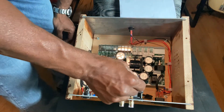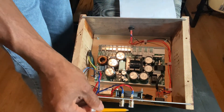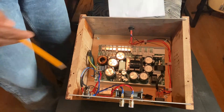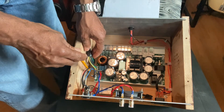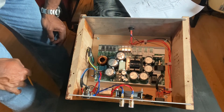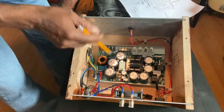I have a cooling fan. I wasn't sure about the heat this would generate, so I drilled several holes in the side of my case and holes in the back, and mounted basically a cooling fan — the kind mostly used for computers. There are DC output connections with this amp. The red and blue wires are 24 volts — I did test these on a voltmeter. The yellow wire is 126 volts, the green wire is 84 volts, and the black wires next to them are the ground wires. This is DC output.